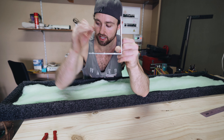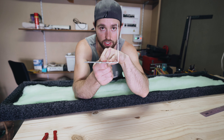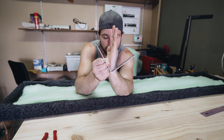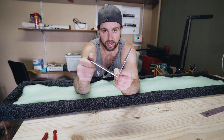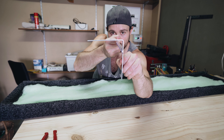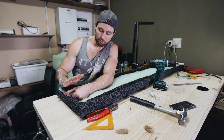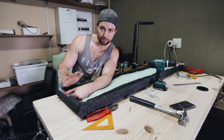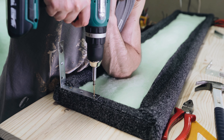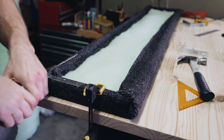Now what we need to do first is attach this bracket to the board, because when we do make that angle we're not going to be able to reach this screw over here. We first need to attach these screws and then we're going to bend this inward to 45 degrees. When we hang it onto the wall the panel is going to be at a 45-degree angle, and using the keyhole mechanism it's going to sit nicely in the corner of the wall for us.